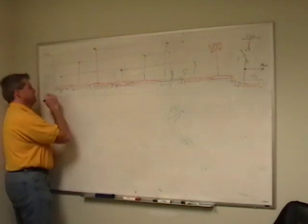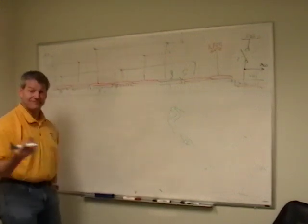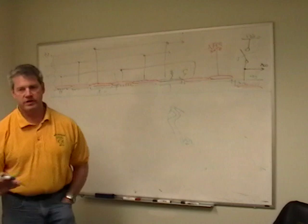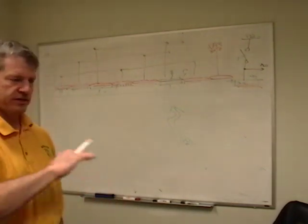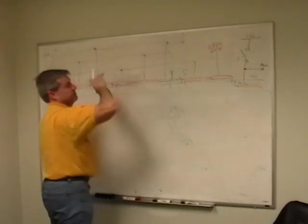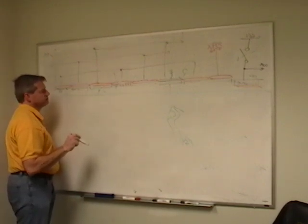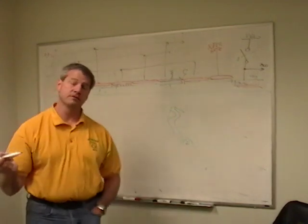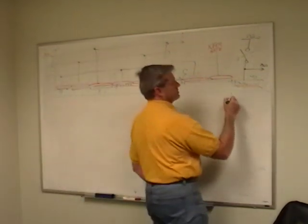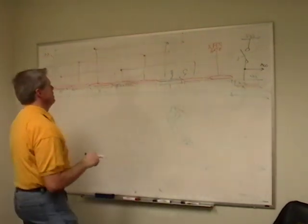So that means then that you have to thin your silicon wafer to the point that it's only, you know, a couple of microns thick maybe, and that's hard because you can do a chemical etch to a certain point, but then you want to smooth it out, and they actually stick them on a diamond table and grind them. And you have to put something on the backside here, then a carrier, to make it strong enough to do that. It's a really tight process. It's hard to do. But you can get there, and a lot of the scientific grade stuff is backside illuminated. But then you have to add some more metal masks or something over here to protect this stuff from light, because then the light coming in is going to cause all sorts of wonkiness on your output.